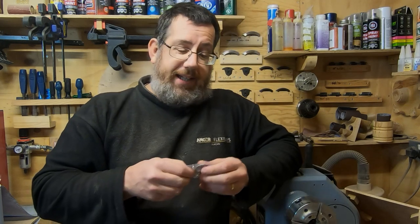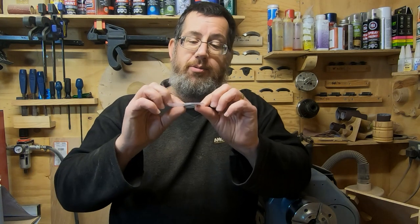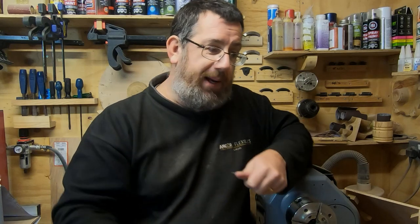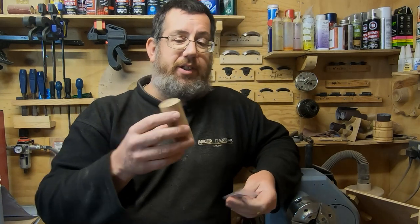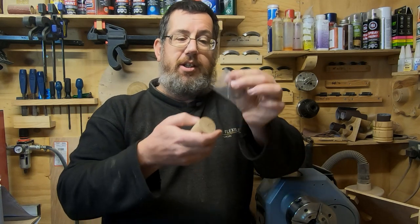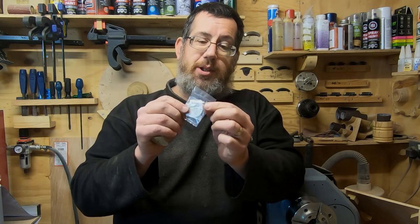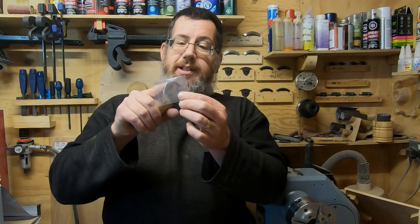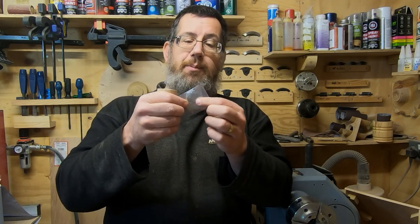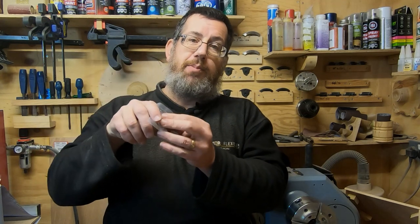The last one I've got here is what they call a disc bottle opener. This one is 36 mil wide. You basically have a hole in the end of your blank, and the idea is you'll put a 36 mil hole in the end for that to sit in. It's got to be a little bit of a depth in there because you've got the screws to go on the top as well. You will also need a secondary hole inside for where this three prong shape goes, so that when you put your bottle cap in, it's got somewhere to go.